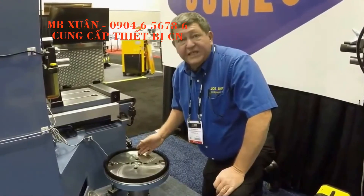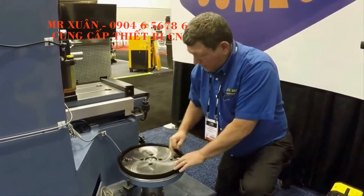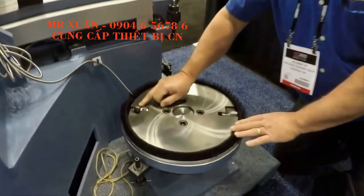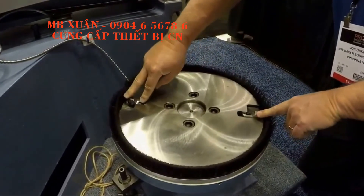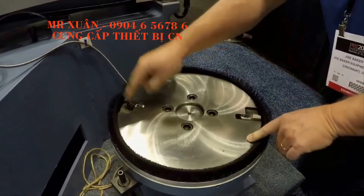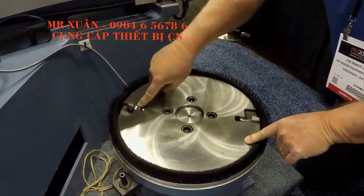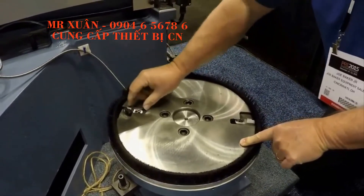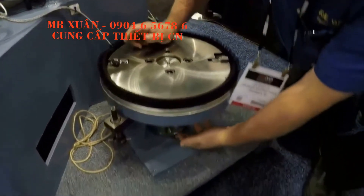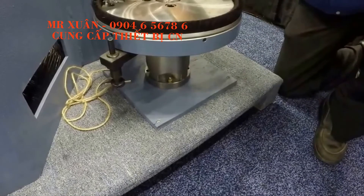This is the standard ACF200 CBN milling plate. It is 13 inches wide and comes standard with two CBN tool holders. The Comec feature of the incline slide PCD acts as a counterweight as well as your PCD. Nothing needs to be taken out to switch from CBN to PCD — just loosen one set screw and move it in and out. Very simple to connect to the machine: tighten four bolts and you are ready to go.